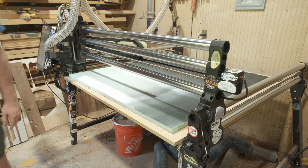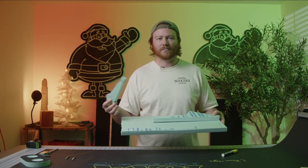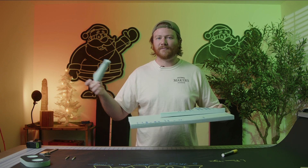This foam is very rigid, meant for construction, one inch thick with an R-value of about five. It's very dense, very easy to scratch — you can easily put your fingernail in it and it breaks. Other foams might be very soft and just bend rather than snap. I chose this today because it's very millable due to how rigid it is. The rest of the four points will pertain to this type of foam, so if you're using upholstery foam you'll probably need to change things.